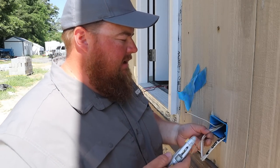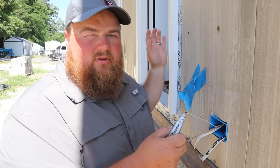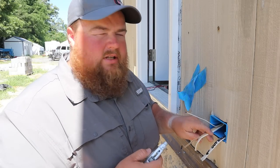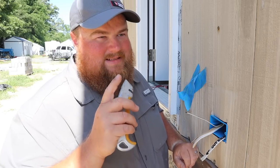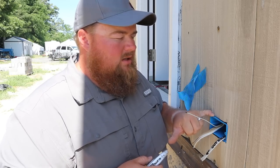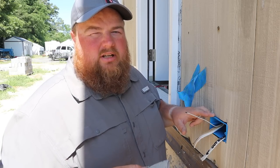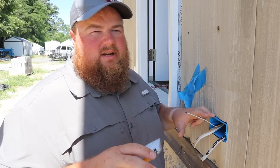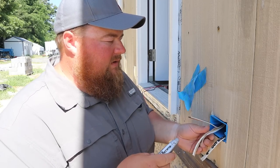Or drywall drying. One of the things that I'm doing right now, I'm out here at the back door. This is the new outdoor outlet that we put right here after reframing the door. I'm gonna go ahead and work on just connecting the wires. I don't think we have our GFI outlet. Although actually, we probably do, I just don't know where it is exactly. I'm not ready to close it off and plug it up for sure. But for now, I'm going to connect these, jumper them, and then go back into the house because I'm working on making sure all of our electrical connections are correct, the continuity is correct, and there's no issues there. So I'm running through a little miniature electrical inspection on our house.